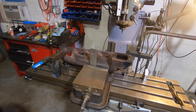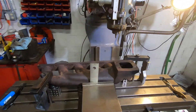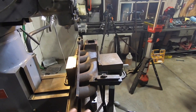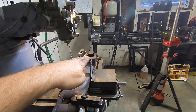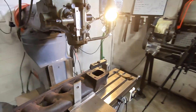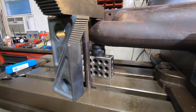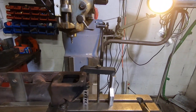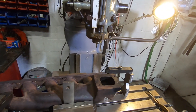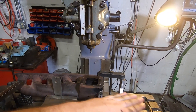One for two there. By far the most difficult part of jobs like this is the fact that none of these surfaces are parallel to each other — they're multi-planar. I've finally gotten this flange flat with the table so now we can machine it. You've got a crazy slope on this one, the turbo angles that way, just crazy. So we have a combination of machinist jacks, one-two-three blocks, toe clamps, and a couple shims. This thing is in there as good as I'm gonna get it and it's perfectly flat to the machine, so now we can drill this broken stud out and face this flange off.